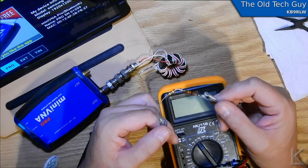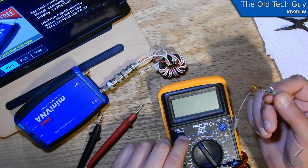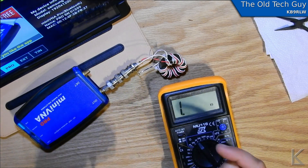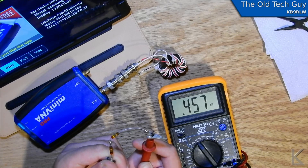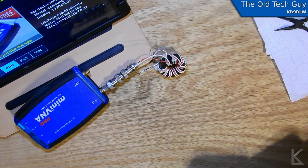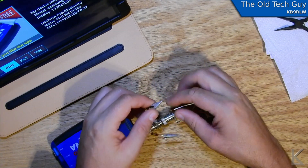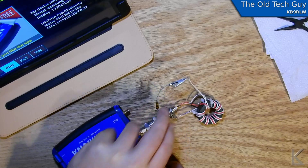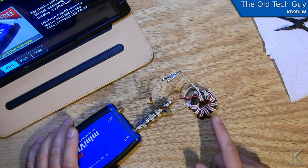It's going to translate 450-ohm impedance down to 50 ohms. These are carbon resistors, non-inductive. I managed to find two resistors that together measure 451 ohms — that's pretty darn close. So I have the mini VNA hooked up to the 9-to-1 and I'm going to clip this resistor on the output wire. If you want to know how to wind a 9-to-1, I already have a video on that — just search for my call sign and 'UNUN' and you'll find it.